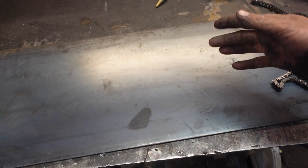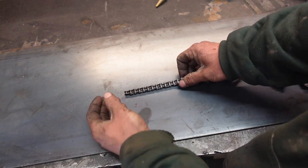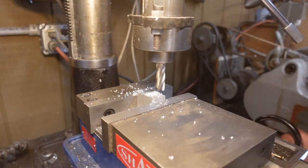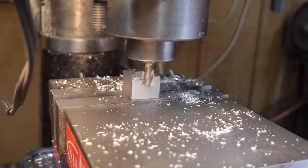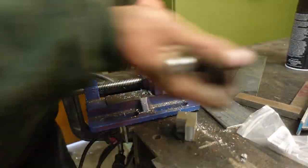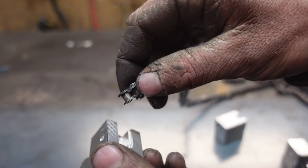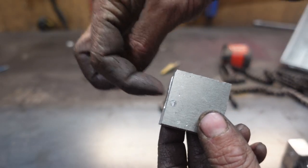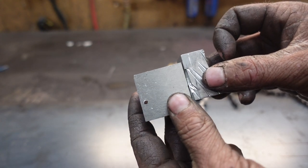That is our rolly flippy bit all built. On the base plate we've got to find a way to anchor the chain down and tension it, so we've got to build a couple blocks out of aluminum because it's very easy to mill. I crashed the machine — I never claimed to be a machinist. This is the fixed side — chain goes in there with a pin through this hole. This is the adjustable side, same thing, and this hole is tapped with a 3/8 inch bolt to tighten up the chain.